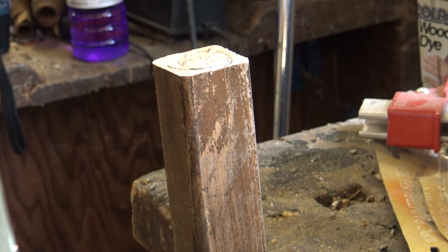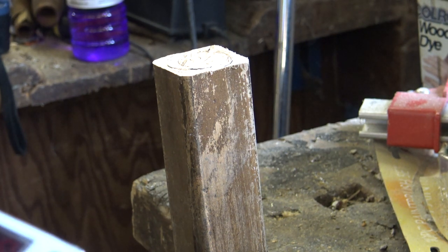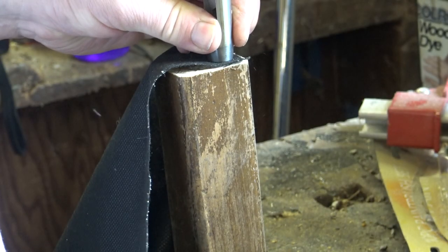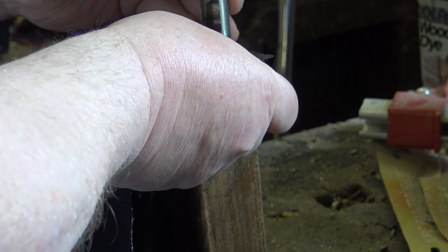And when you put the front on these sets, if they're missing, you see the works of the radio. And so the current job in hand is that these are missing. And on all the scrap chassis I've got, they're all missing. I just made that one earlier just to prove I've got the right punches here. So we want to make another one, two, three, another five. So I've got a piece of oak in the vise. It's just a matter of punching out with a readily available wad punch. Six of these. Or five, because I made one.